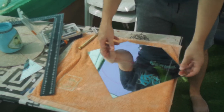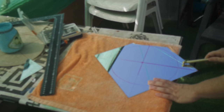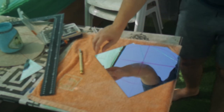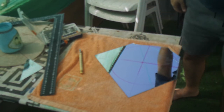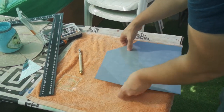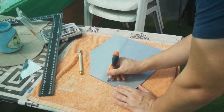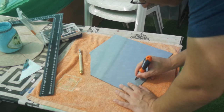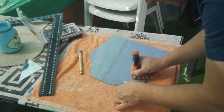I saw a video using that little ball on the back of the cutter - I didn't know why they did it at the moment. The actual reason is you tap it and the crack splits open. This actually cracked a lot nicer so it looks okay even if I've scored it multiple times - but I was just lucky. Glass wants to crack where it already has a crack made, so if you make multiple score lines you create weak points that make it really hard to control where it cracks.